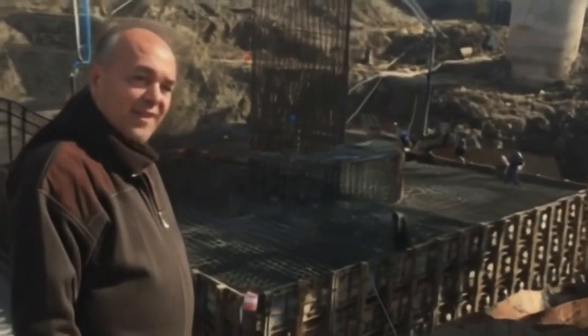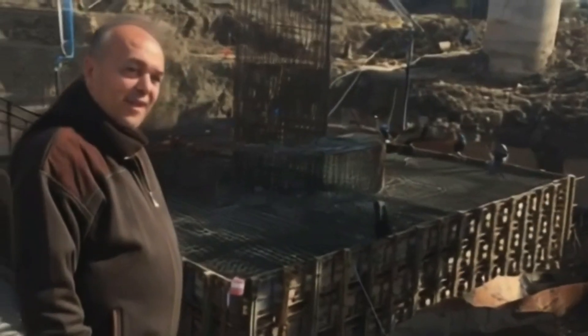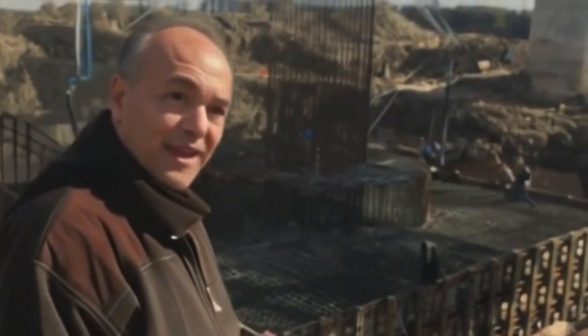Welcome to the two-lane railway bridge site. This is one of the pillar caps of this bridge at the bottom of the Euphrates River in Samawa in central Iraq. The volume of concrete used for this cap is 700 cubic meters, and the required concrete compressive strength is 30 newton per square millimeter.